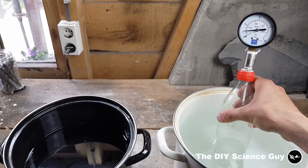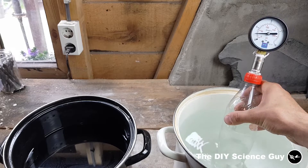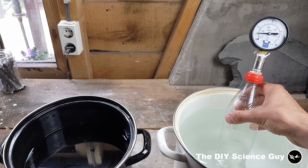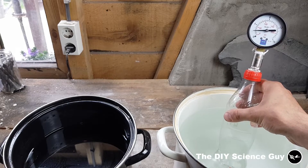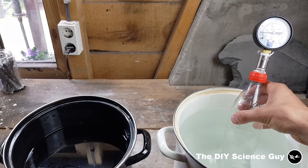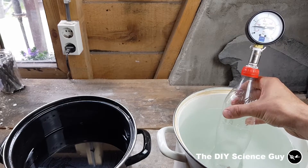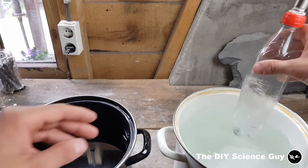For this experiment I'm not going to go much higher than two bar, just for safety because I'm using these soda bottles. Although they can handle quite high pressure — I believe around 11 bar — with air that's pretty safe, but not when you have butane in it, because that would be very explosive. It's now two and a half bar so I think that's enough.